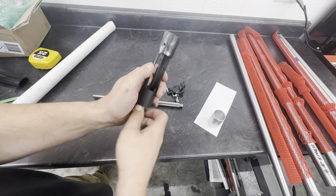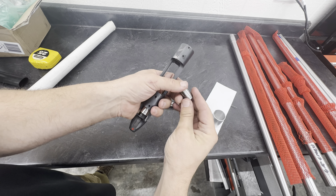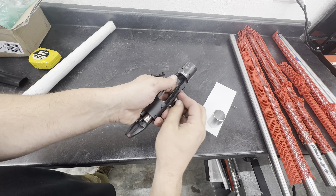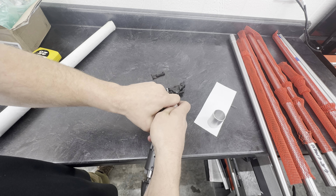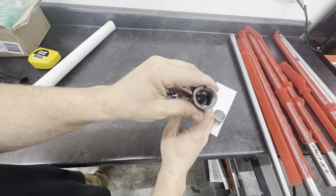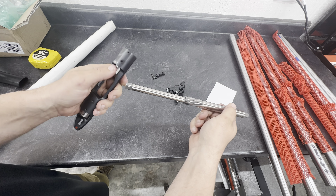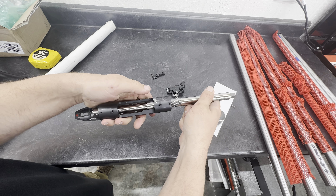I'm just going to install the barrel and do the receiver work. I got taper bushings that match the bolt raceway — you can see here it's 700 to 705 taper, and this one's the same. These taper bushings will fit inside the action and follow the bore. See how it sets in there — it comes out and lines up with the bore raceway.